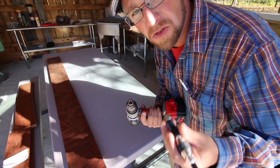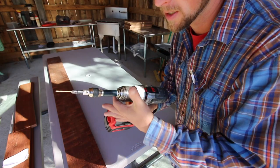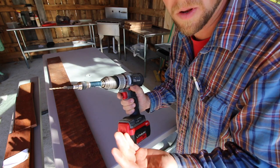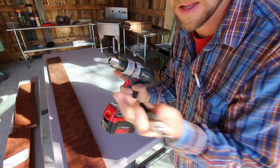You've got to insert your drill bit — your screw bit, whatever you're going to be using — into your chuck. If you want to tighten it, you want to put your drill in the on direction, put your hand on the chuck, and just pull the trigger. That snaps it in place and locks it. When you want to undo it, you put your drill in reverse, hold the chuck, pull the trigger, and it takes it out.